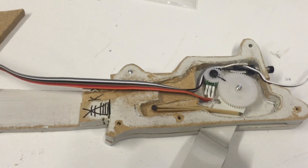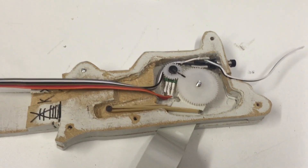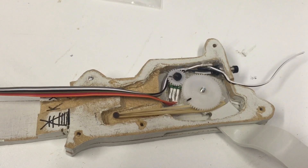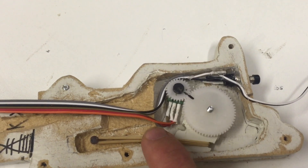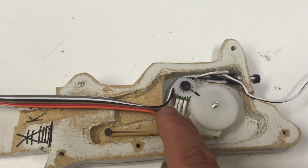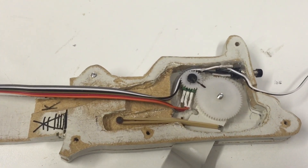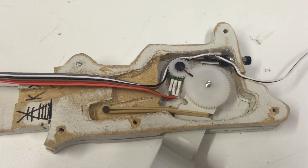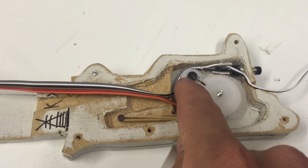I've done it a bit differently — I've installed a potentiometer instead. The part is a 10k, and when I move the handle, because of these gears the pot turns. In my opinion this is better because with micro switches you need wires going all the way around, whereas I can just have three wires here going to the simulator. I use a large gear here and a small gear here because the handle moves only about 40 degrees, but you want the potentiometer to move as much as possible, so a large and small gear gives you a good ratio.